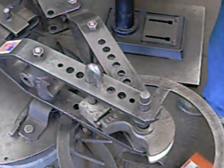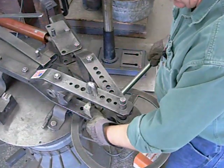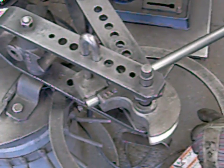Now we're going to insert our tube into the die between the back block and the form die. You insert your tube like so and give it a little twist and things lock up — you can't pull it through. I'm pulling on that with that little twist here.